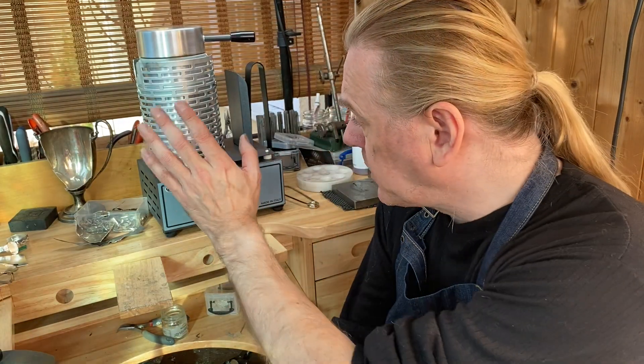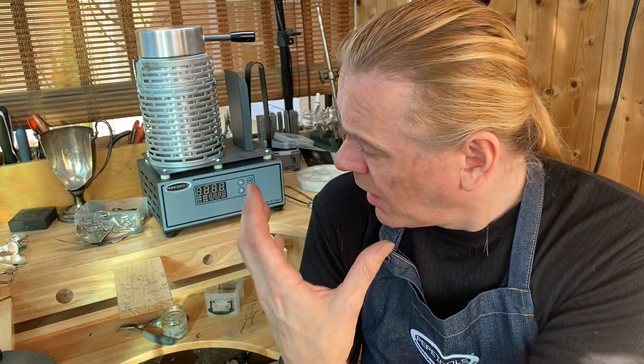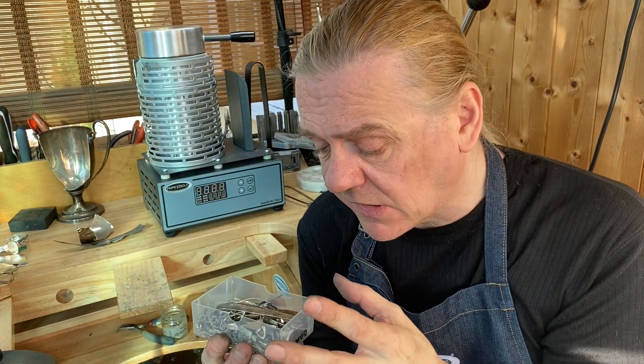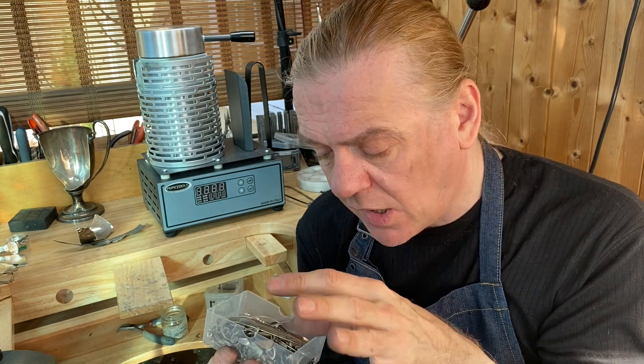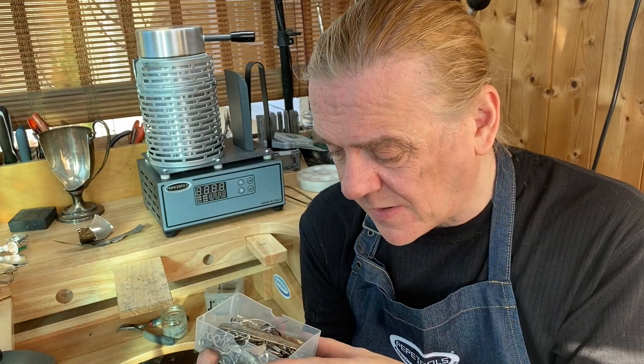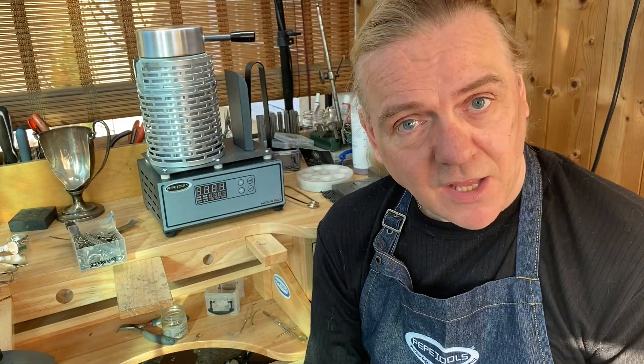Another important feature regarding placement is you need ventilation. Especially the first time you use it, you're going to get quite a bit of smoke as various things burn off. If you're recycling scrap jewellery, there's dirt, tarnish, bits of glue and adhesive from the backs of stones, makeup, skin, hair — all kinds of nasty things in there. So when you melt this down, you're going to get a lot of smoke and fumes. I can't stress this enough: use one of these in a well ventilated area. Grab your safety equipment, grab your furnace, grab your silver and follow me.